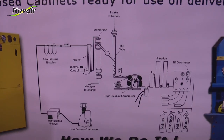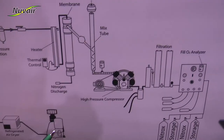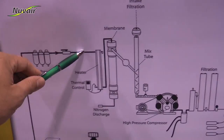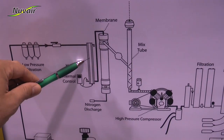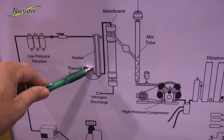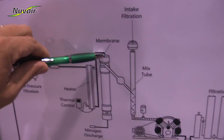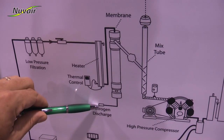Your Voyager 2, 3, or 4 has a rotary screw compressor. The rotary screw compressor produces the low pressure air, where it goes through the refrigerator dryer, through your low pressure filtration, into your heater, where your thermostat controller tells the heater to turn on and off based on the temperature and also how much pressure is coming into it. You have to have a minimum of 80 psi for the heater to activate. The air comes out of your heater into the top of your membrane. Most of the air goes through the membrane — the nitrogen comes out the end on a fixed discharge.